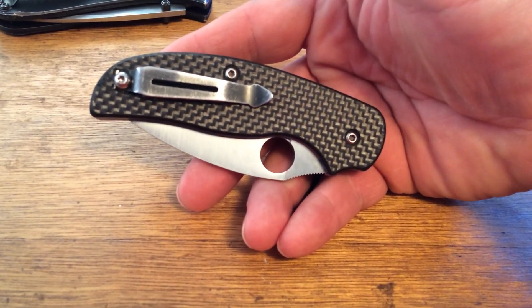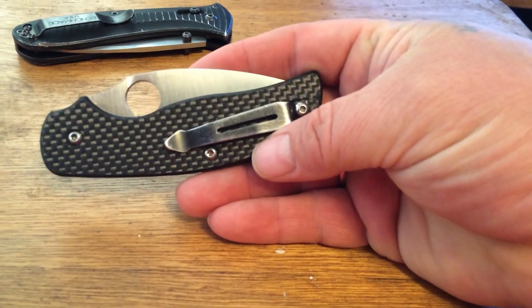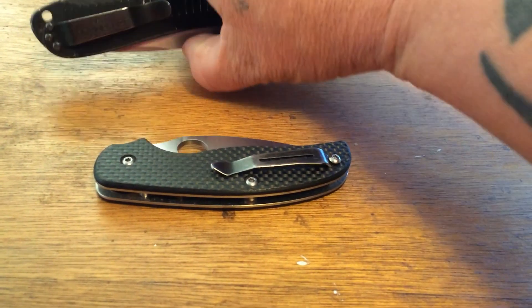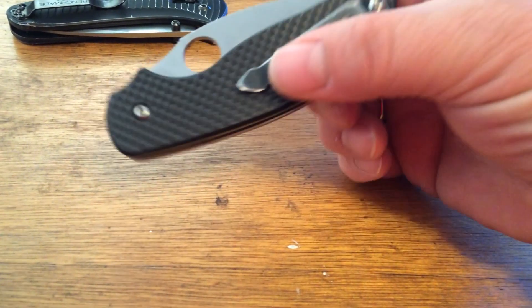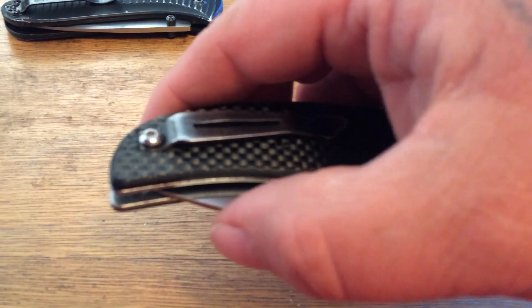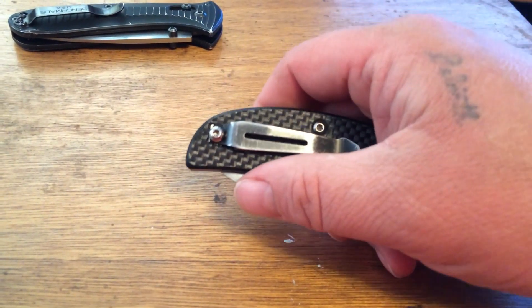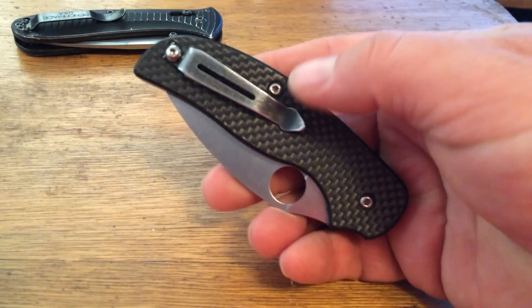So there you have it — it's the Spy Bench mod. This is an old pocket clip off of my brother-in-law's 580 Barrage — I had switched his clip to one like this only in silver, and this is just his old clip. I took it and modified it using a cutoff disc on a Dremel tool, shaping it so it would seat flush with the handle scales. Then I epoxied it down and re-loctited both screws.